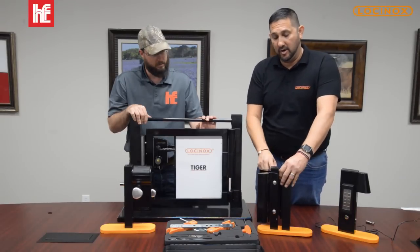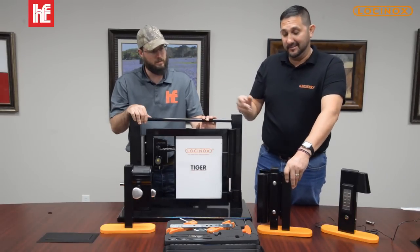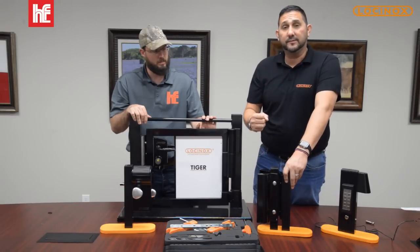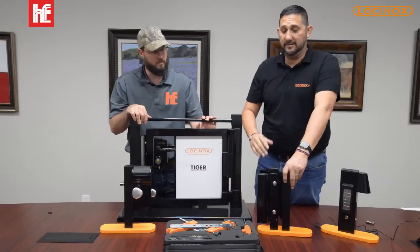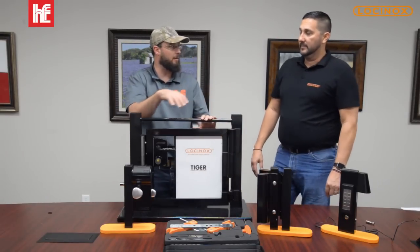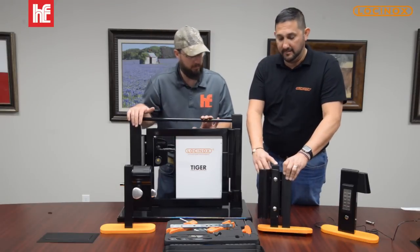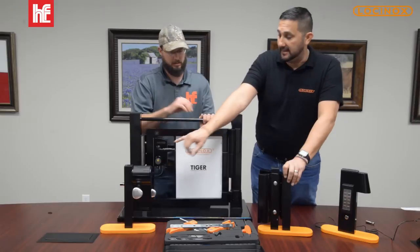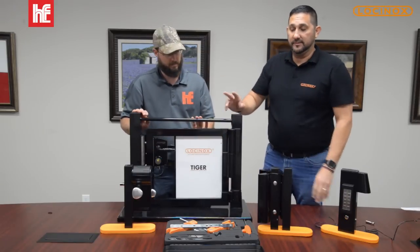You're going to get the magnet and the armature. You can use the same jig system. It's only two holes for this and three holes for this to get your power to it. It's all drilling, bolt system, no welding, no lock boxes, no anything. You're in and out of there in 20, 30 minutes tops. Does this come with the Maglock itself? This is the Maglock. Okay, perfect. Yeah, this is all the right Maglock. So the Maglock with the handles. You can get this in black or silver. Same thing with this lock, black or silver, the two colors.